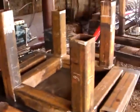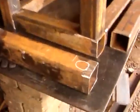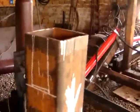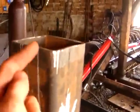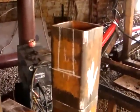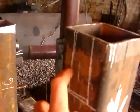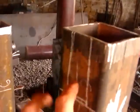So the power cube frame is balanced together, and I'm going to torch out these holes as I've done here as we go around. I'm going to torch out a letterbox for the fuel compartment, which I'll explain in more detail later, but basically the reason for that is so that all the fluid can get through, and it can completely drain empty. If the hole was only up to there, there'd be all the fluid below the hole that wouldn't fall down to the outlet that's going to be tapped into here.